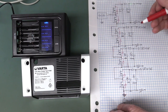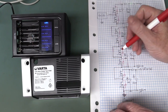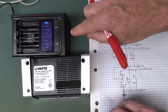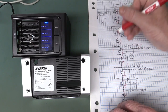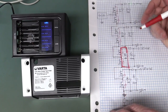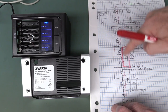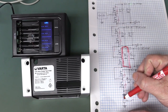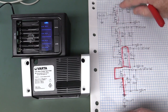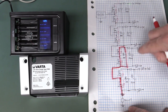What we don't know is how they're actually doing the discharge. In discharge mode, if you turn both MOSFETs on, you'd short out the battery. In the teardown I couldn't find any current sense resistor for discharge, so they must be switching it on and possibly using the main current shunt resistor at the bottom — perhaps discharging all cells in series just like they charge in series, then calculating discharge current based on the differential sense voltage across each cell.